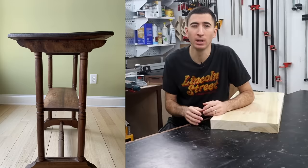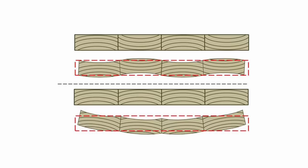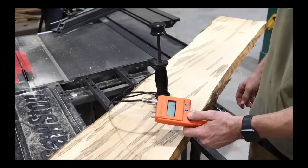Because like most things in woodworking, there are other factors to consider. For instance, if you go to Home Depot and buy a bunch of 2x6s and glue them together to make a tabletop, it will likely not stay flat no matter what you do with the growth rings, because the wood isn't fully dry yet. So you're choosing between a U or a washboard. Instead, you should be using wood that you know has been properly kiln or air dried for the right amount of time, which is a rabbit hole of a topic — I'll leave a link below to a video that covers it in full detail.